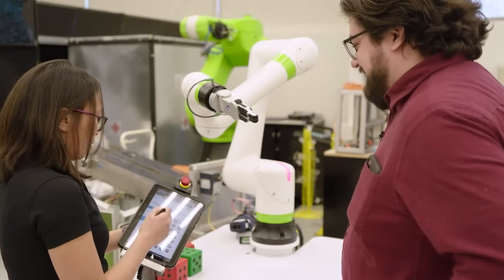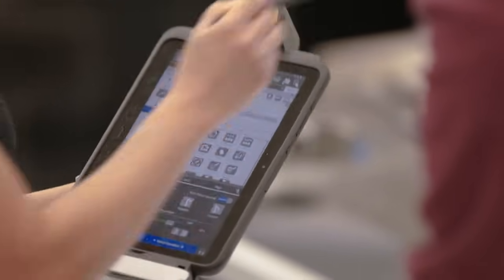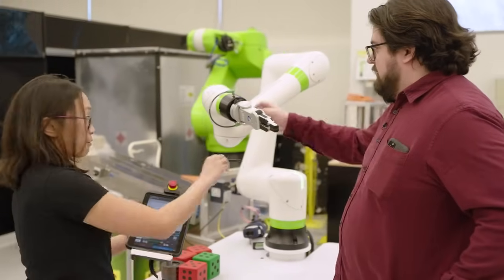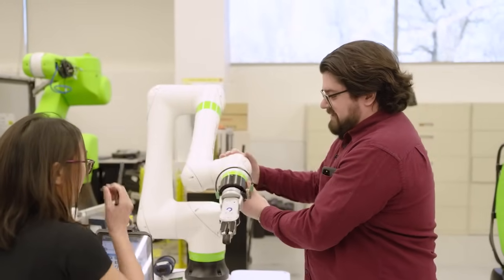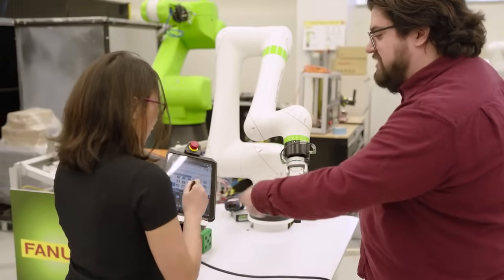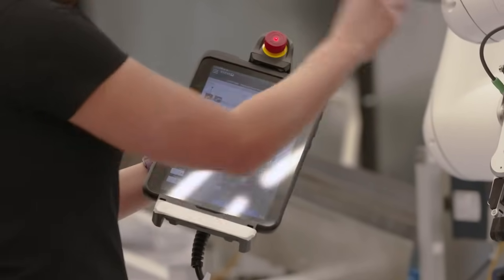It's visual — for visual people, exactly. It's just a timeline; you click and drag. If you want to move the robot, there's what we call freehand teaching. You just need to make sure this indicator is green. When that's green, you can move the robot. Just move the robot wherever you want it to go. That is so cool — it moves so easily. And there's actually a way if you need more precision, you can change the resistance. So now let's say you stop here and click and drag — this is a joint position. Now it just taught that point.